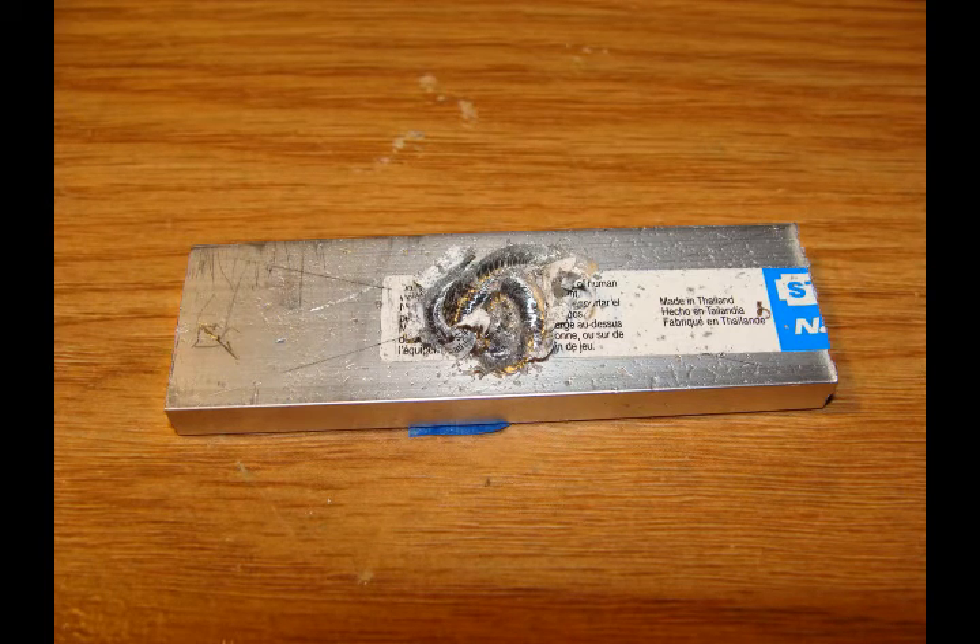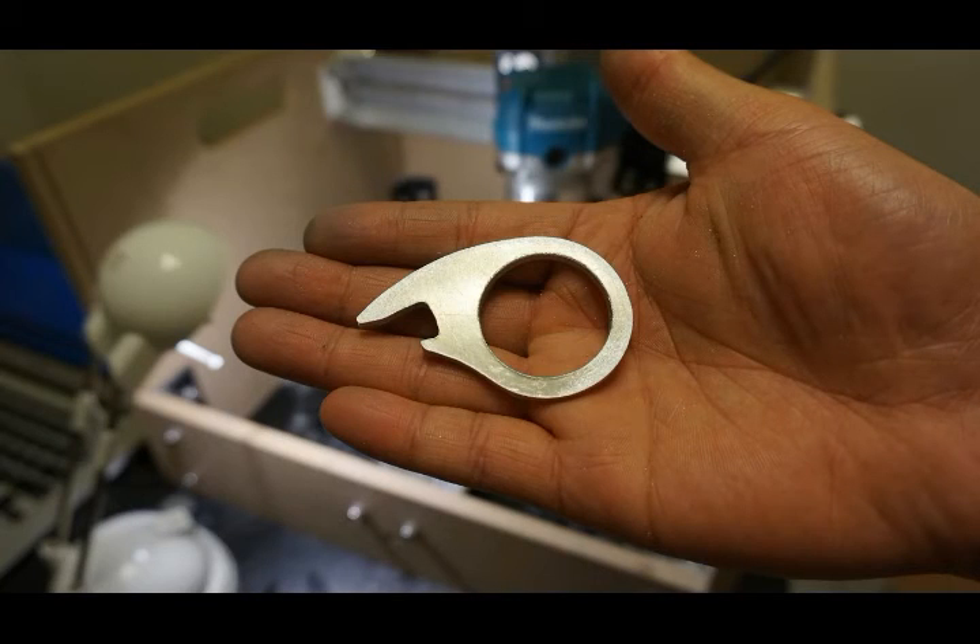It will do aluminum — I've seen some videos of it, and the cut that I was getting before the bit broke was obviously going well. It was just a two flute bit. For an end mill, when you're milling aluminum, you really need at least a three flute. You want to be able to adjust your feed rate and your speed. If you can't adjust your speed, then you have to lower your feed rate. It is possible to get aluminum cuts with this machine. I was just only working with what I had, so I'm going to order some new bits and come back to it.